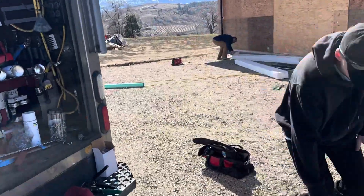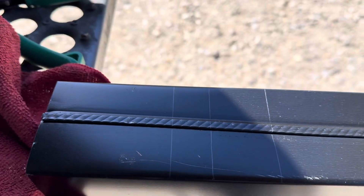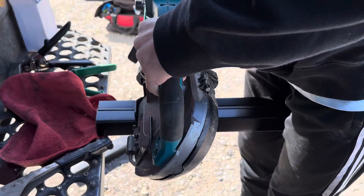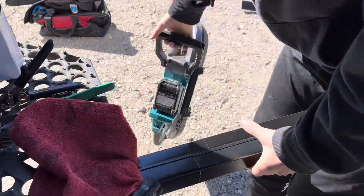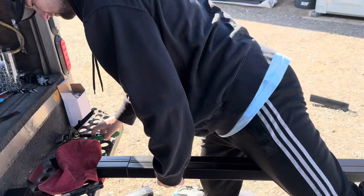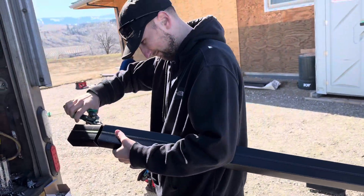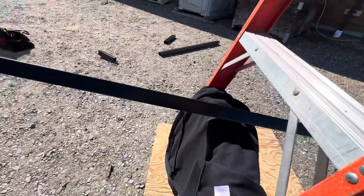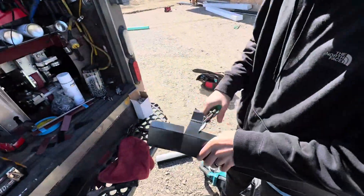On the downspout square, we marked four inches here, one inch here, and an inch and a half here — we're gonna cut it off. We have to make sure we don't over-cut, so Pavel does the professional square downspouts. He's got a ladder set up with a coat on it so we don't scratch the downspouts, and then he just cuts them out.